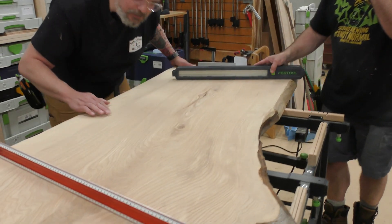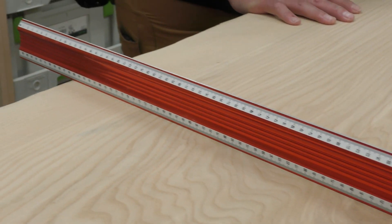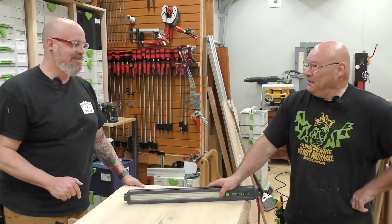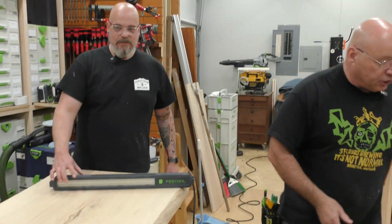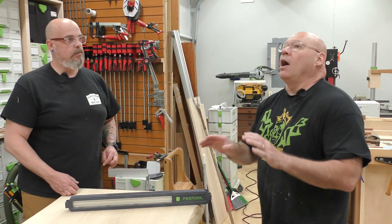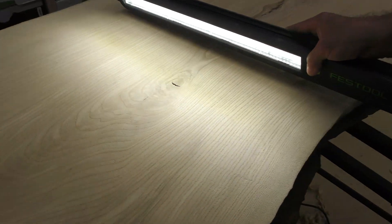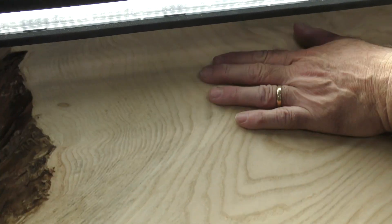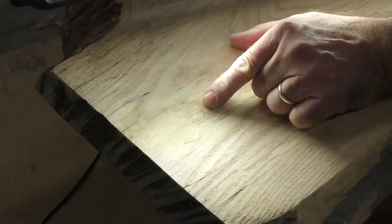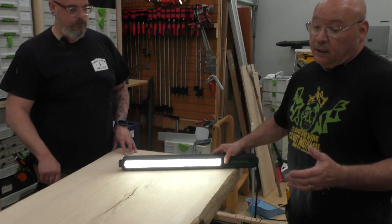How did we do? It's pretty wicked flat. You're becoming a northerner! There's one more thing — I'm going to check the whole slab with my straight edge. This is not the final sanding, so I'm just inspecting for heavy tear out. We have got everything accomplished that we had circled. No heavy tear out — of course you're going to see huge scratches from the 40 grit.